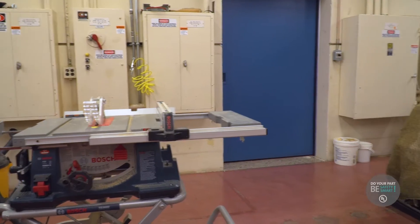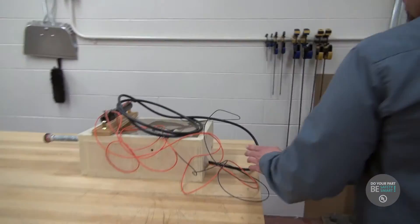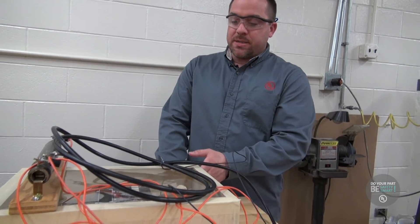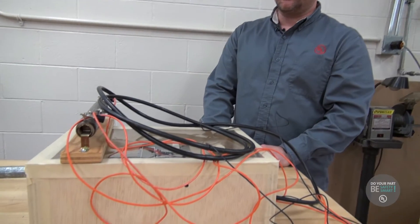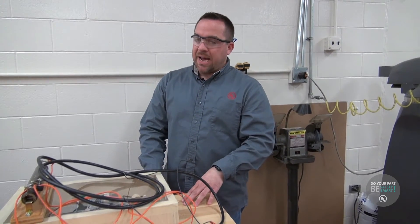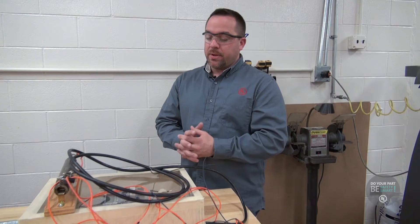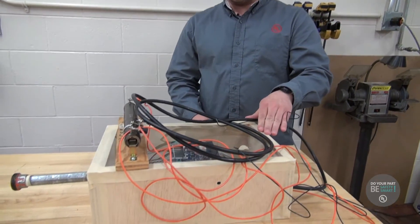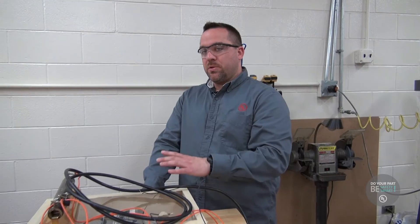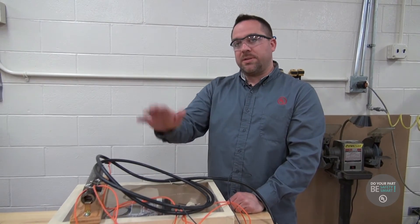After seeing tools and wooden boxes on the far side of the lab, I asked Tim to tell us how they are used. This box houses our sample inside. The purpose of the box is to encapsulate and create a surrounding atmosphere around the sample. The explosions caused within the samples have to be contained inside. The reason we build a box around it is to create that surrounding atmosphere — we cover the top with plastic, and if the sample fails and the explosion comes outside, it will ignite the surrounding gas atmosphere and blow the top of the box off.